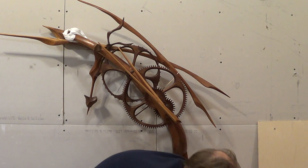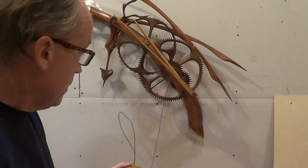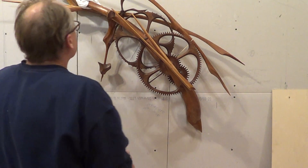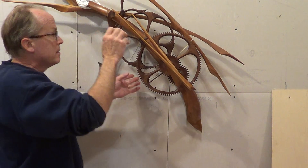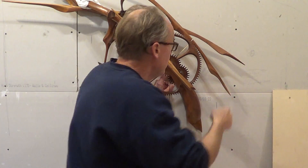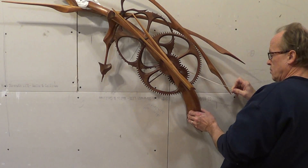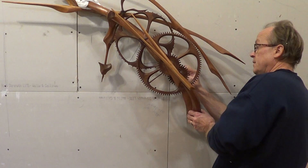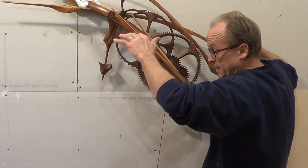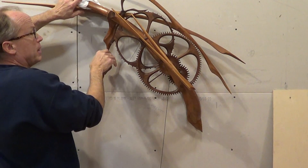Now I'm going to pull the weight out of that little box where it was sitting and just let it rest on the floor at this point. The pendulum has been held in place by a rubber band — carefully grab the rubber band and stretch it way out over that point on the pendulum, then take it off. That kept the pendulum in place so it doesn't move around while you're hanging the clock, and it keeps the suspension strings in the right position too.